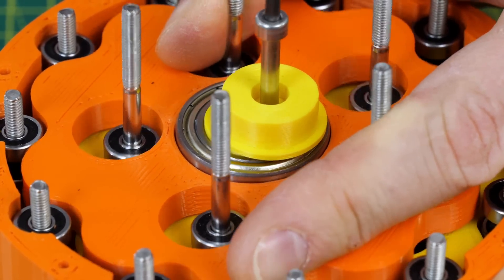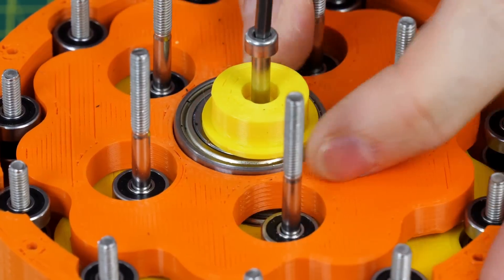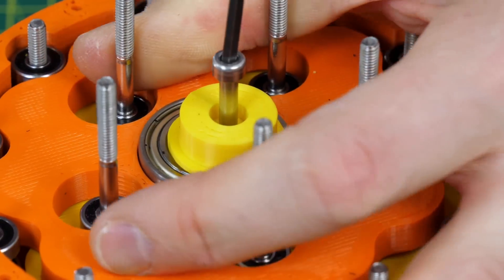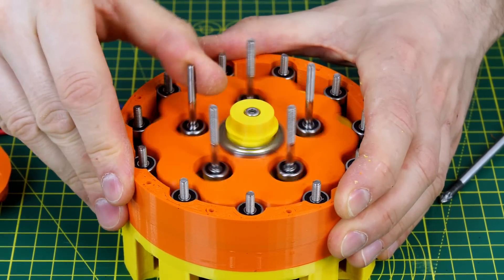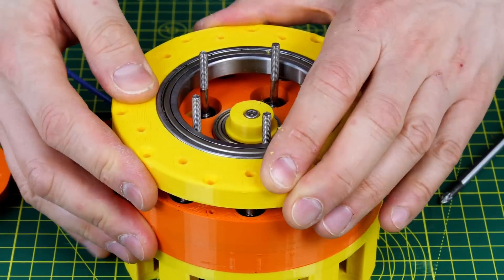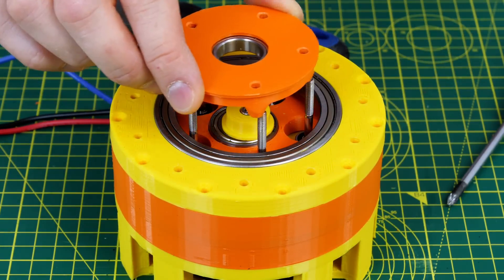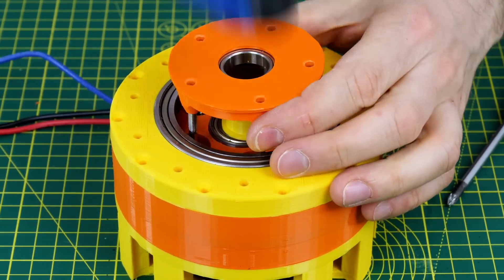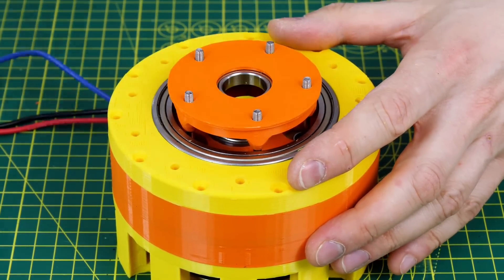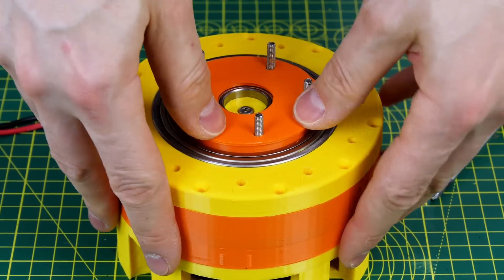The last part of the camshaft assembly is a cap which fits into the bearing on top of the motor, and that M4 bolt screws all the way through the camshaft and into the captive nut right next to the motor. It's quite tight and a bit tricky to screw in because the motor wants to turn, but once fitted everything runs pretty smoothly. Then there's a cap with a large bearing in the middle matching the cap on top of the camshaft, fitting into the big bearing which provides our bolt holes to attach whatever we connect to the output shaft.